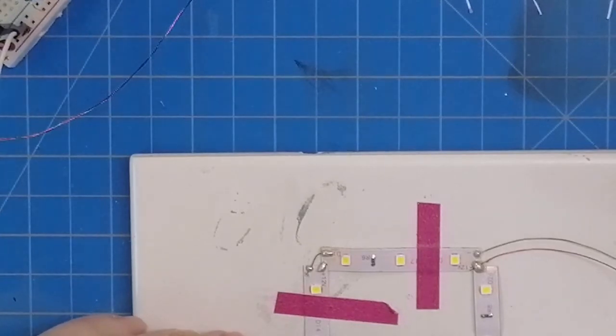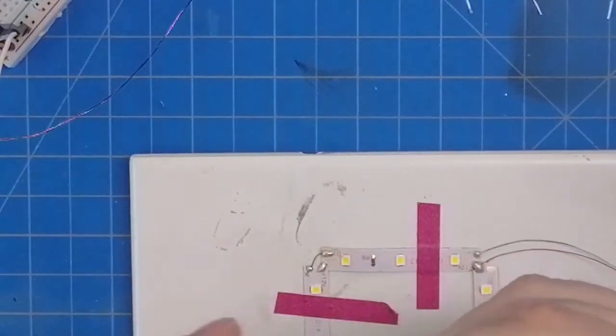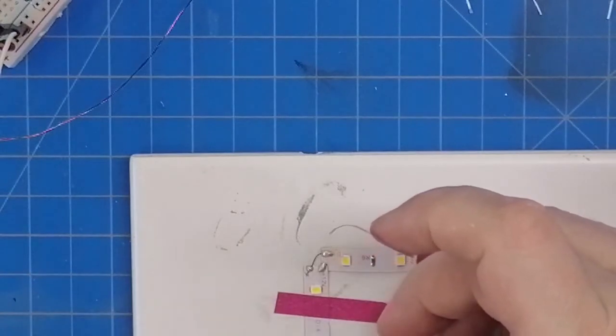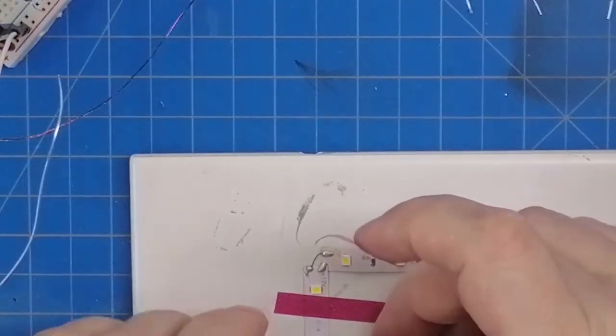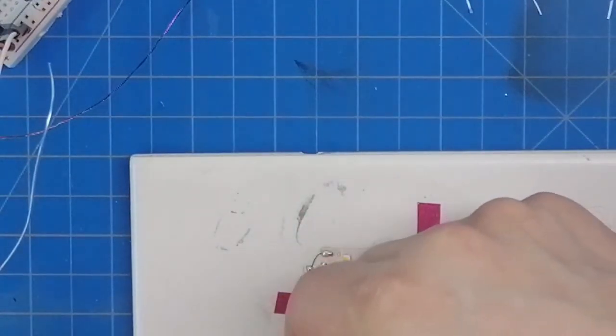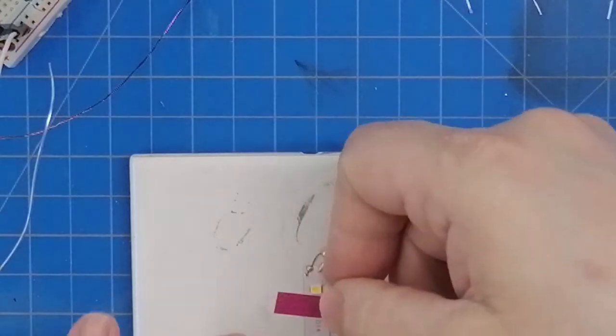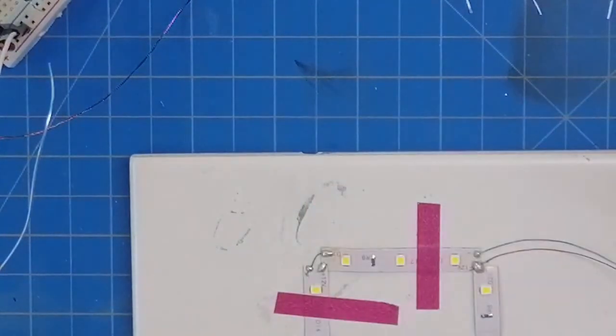That one's not quite as pretty as the last one. But the key thing is the solder is trapped in that ball. And that ball, while it looks big compared to the pad, isn't bad. Nothing's gonna heat this solder back up to the temperature that it's gonna flow over and short out or anything.